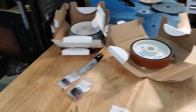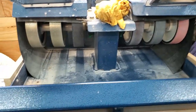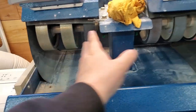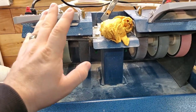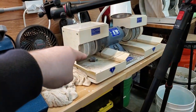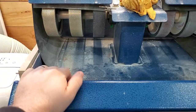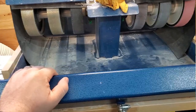Going back to these wheels — what I'm gonna do is adjust this machine a little bit. We're gonna take off these two hard diamond wheels and replace them with the soft Nova wheels, and actually shift things around. This will be mainly for the soft Nova wheels. I still have two hard diamond wheels on the other side, so having these here isn't really needed right now. This side could be more of a finishing station rather than a hard grinding station. Let's go ahead and swap out those wheels.